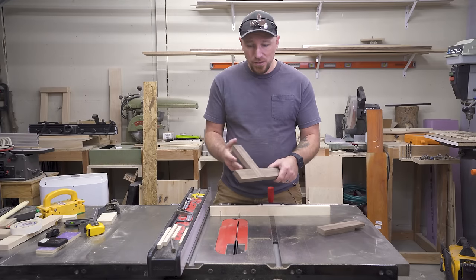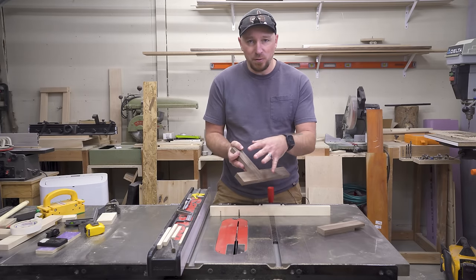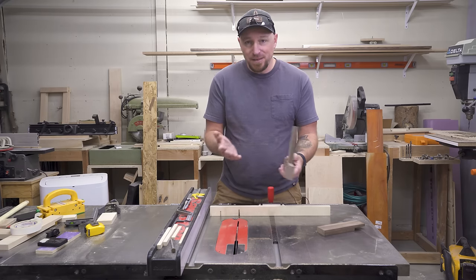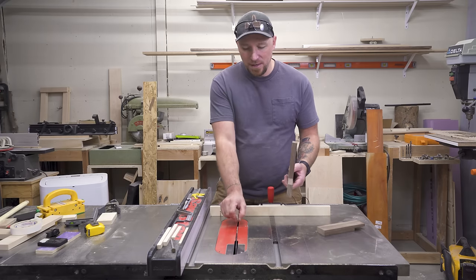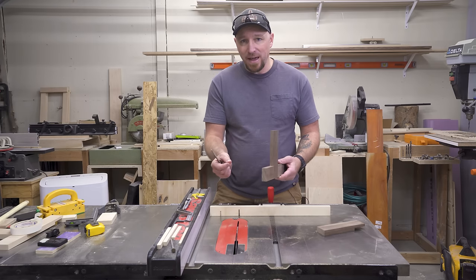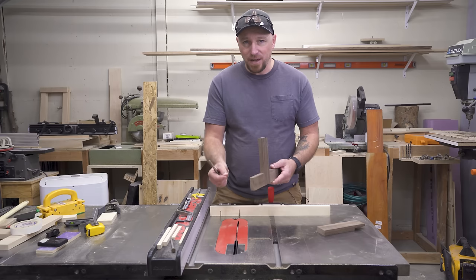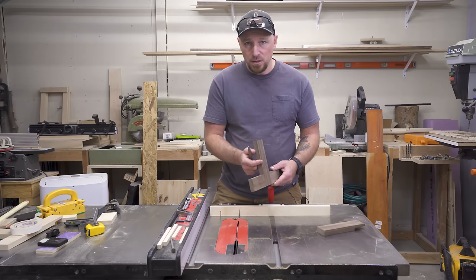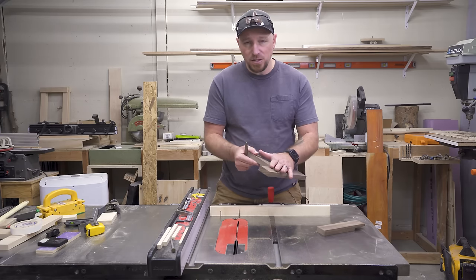That's half laps on the table saw. We used the working dimensions of the material to get perfect results instead of relying on pencils, knives, or marking devices — and it works really well. The key, of course, is also having this shim cut to the same thickness as your blade. As far as getting the height, you could measure and mark that out, but keep in mind you're still going to have to make a couple passes to get it fully dialed in. If that gets you a little more accurate, then why not — but this method is going to be perfect just the way it is.